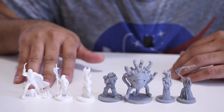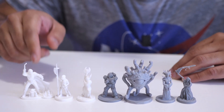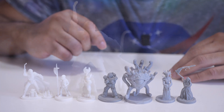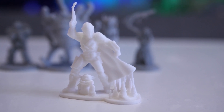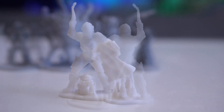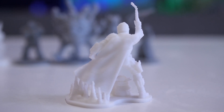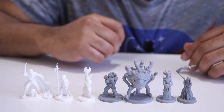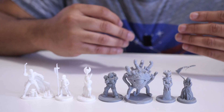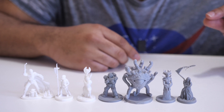The white models over here were printed with Elegoo's matte white filament, and as we get a closer look at these, this is the Mandalorian with Grogu. The matte white filament does a good job at hiding layer lines compared to other types of filament, and I think that this model came out looking pretty clean. Although, when you're dealing with filament, the smaller details are gonna have a harder time coming out, especially with this standard 0.4 millimeter nozzle, but you can still make out what everything is supposed to be. It's just not going to be super, super detailed.